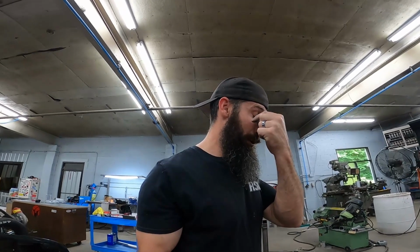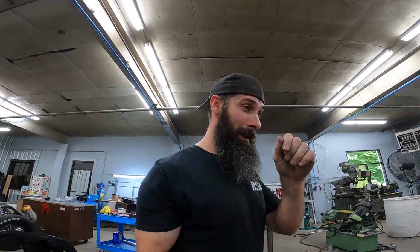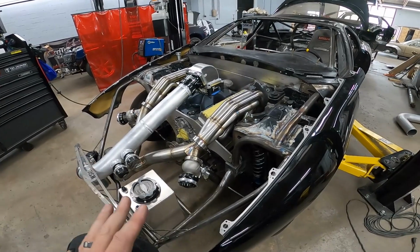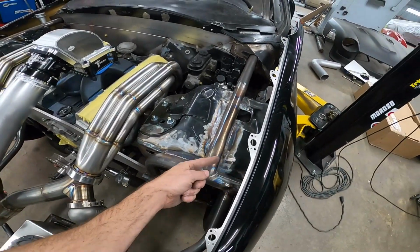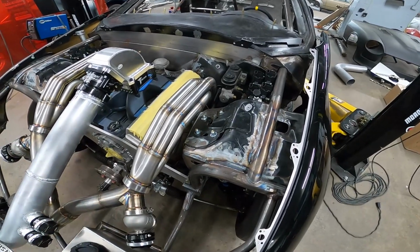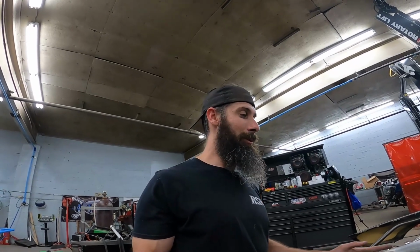If you go back to the video, you'll notice that, because Jonathan said the air going into the engine bay actually blows the hood up a little bit going down the track, and we didn't think it would be an issue. But his wrap is starting to discolor just a little bit right where the cowl and the hood goes up, and I don't like that. So with Steve's car, I actually built the driver's side header here and had it completely mocked up, and we had put the hood on already, and I had a string across here to get my height, and we put the hood on, and the hood touched, or it didn't touch, but it was so close it was gonna touch, and that just completely knocked the wind out of me on doing the headers.